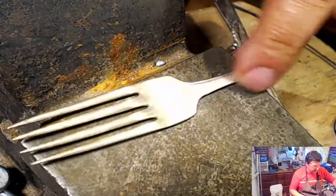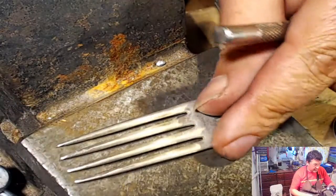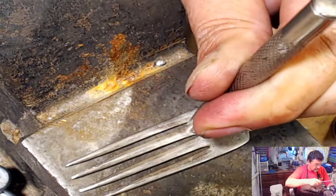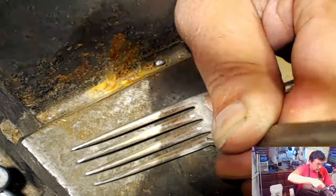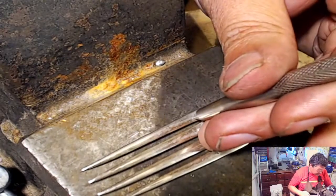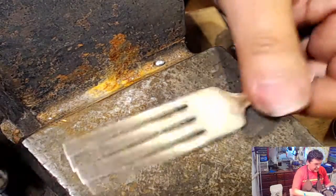So we have our full fork here. Whenever it's like this I like to go down the same way - the ends touching - so you get a nice flat thing. I always start with the center tine because it's going to drop down. Remember you're wanting to keep these in the middle and keep your punch going in the direction you want the drill to go. So we've got our dots here.